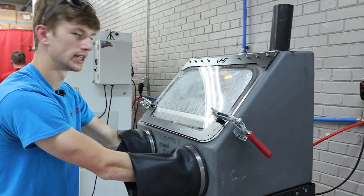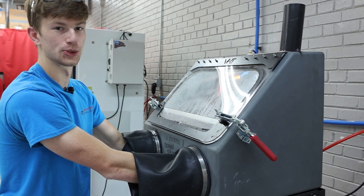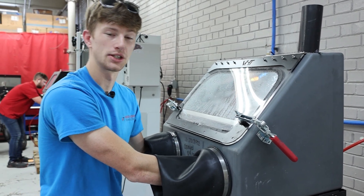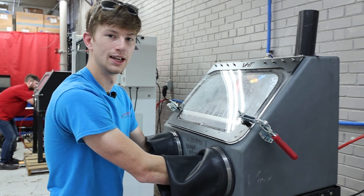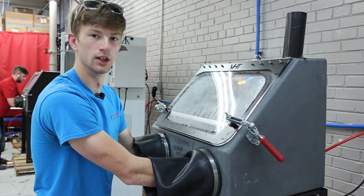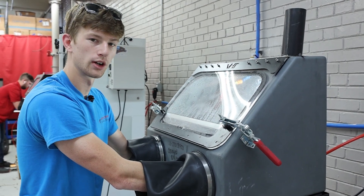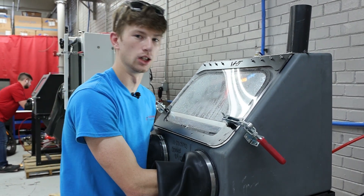We managed to fit the part into the 700. This is a 120 to 270 mix of ceramic. Ceramic is very similar to glass bead, but it's actually solid, so it hits the part a little harder, and it lasts about 10 times longer. It should give a slightly darker finish than the glass bead but may clean a bit faster.